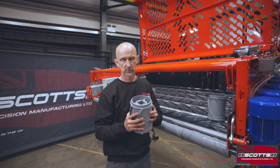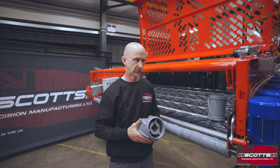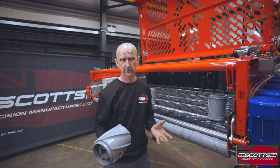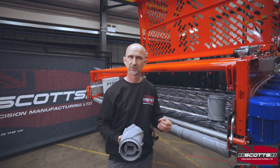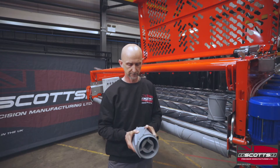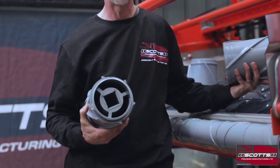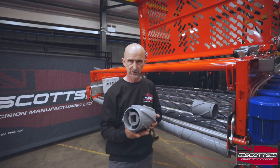Moving on to 90% of what we sell - you can still use this more aggressive roller on small potatoes, but we're really looking for moisture and loose soil mixed in with it. The loose soil itself will stick to the leading edges of the rollers, which makes them less aggressive as well. So if you're a main crop grower harvesting set-skin potatoes through autumn when conditions are more moist and there's more clod and more soil to deal with, this is the highest-performing roller we do. What's different about it: the body diameter is bigger on the less aggressive roller - the idea being it fills up the gap between the clod rollers, leaving less opportunity for anything to escape. Slightly smaller body here, but the ribs are more pronounced and there are more of them.